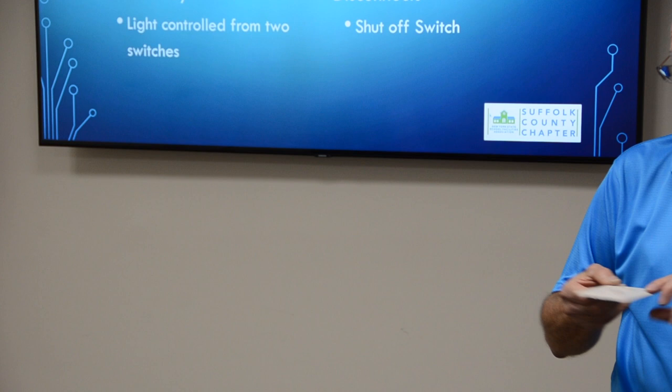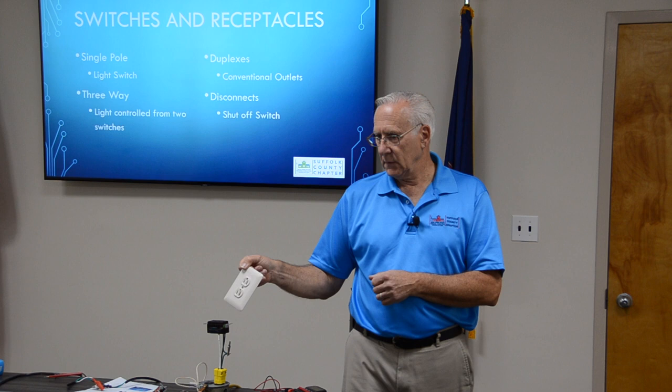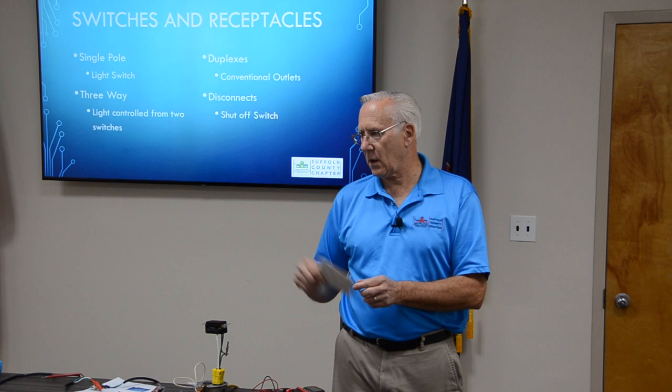Paint on this thing. Are you supposed to paint this? Absolutely not. Take a look at this. This was stuff that I took apart. I couldn't get it apart. Completely blue. Completely painted it. If your painters are doing that, shoot them. Ask questions later. Do not paint the faces of the receptacles. Take the covers off. Take the covers off. This is ridiculous.